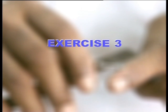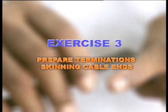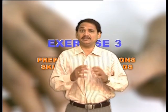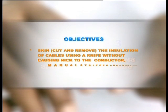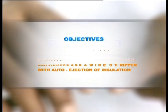Exercise 3. Prepare terminations. Skinning cable ends. Yes, students, in this exercise we will demonstrate how to skin different types of cable ends with the proper tools for the skinning. At the end of this exercise, you shall be able to skin the insulation of cables using a knife without causing nicking to the conductor, a manual stripper and a wire stripper with auto ejection of insulation.